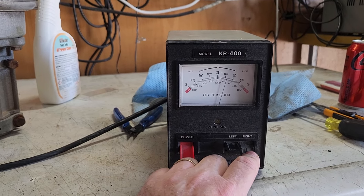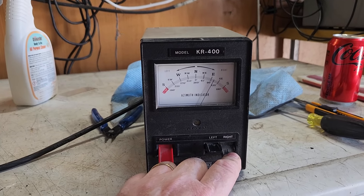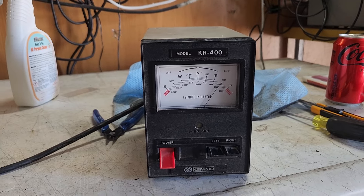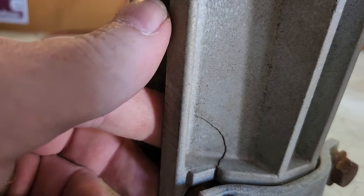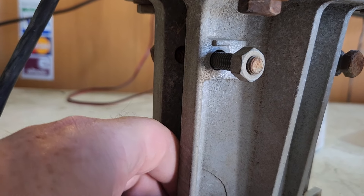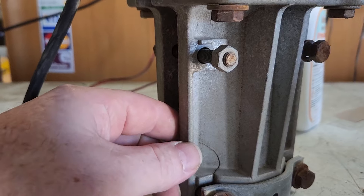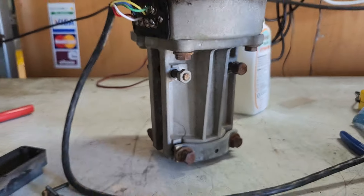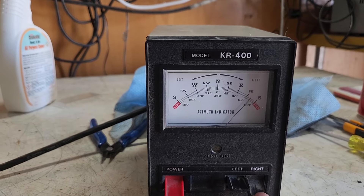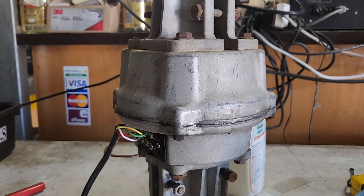Running it one more time through the south — they were pretty bulletproof, and I think that's what people liked about them. The Yaesu design and Ken-Pro: some would say on some models you've really got to look very hard to see the difference. I'm just noticing — have a look at this — there's a slight crack in that bracket there. It hasn't gone all the way through, but this is some of the stuff with alloy parts that can happen. There's a little bit of movement there. Would it stop you using this bracket? On a portable situation probably not, but if we've got another bracket, certainly we'd replace that. The alloy cases and alloy brackets kept the weight down on the rotator, but it's certainly something to consider.